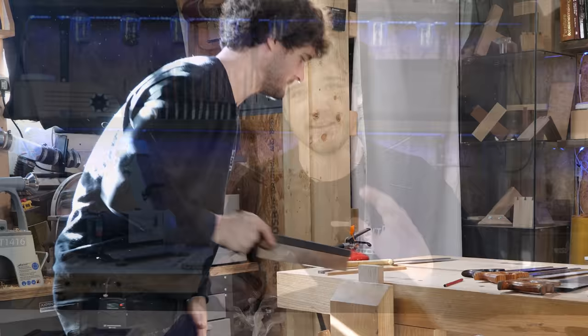To summarize: you're pretty much standing perpendicular to the bench, you twist your body around, get everything in line, and then just do long strokes. That's going to naturally get your body out of the way and get everything in line. Line of sight is very important when sawing because most of the time we're trying to cut to a line.